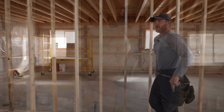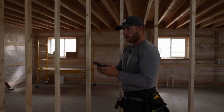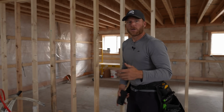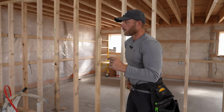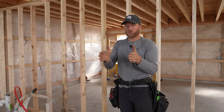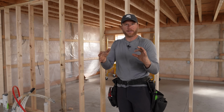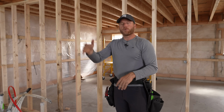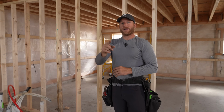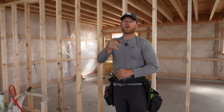Divide that by 15, is that right? Yeah, 7 1/4. Perfect. So 7 1/4 inches is what I wanted because I've got 2x8 risers. So all of my steps will have a 10.5 inch run with a nosing. So it'll actually be like a full 2x12 step. And then we'll use a 2x8 for our riser. And with that information, I will now go ahead and build or cut my stringers.